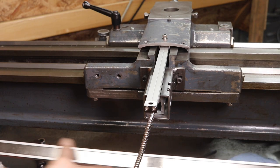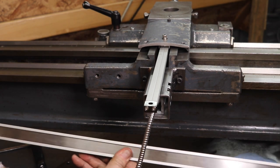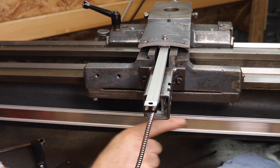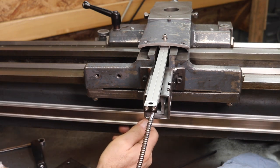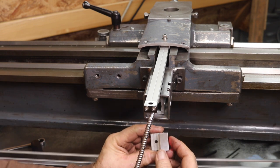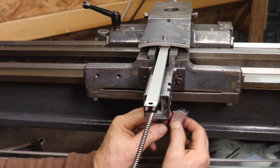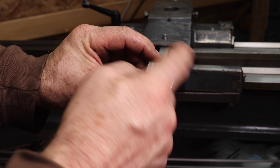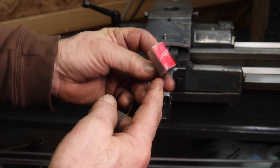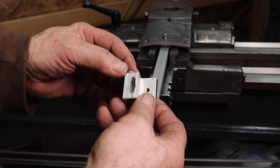I'm working in a very cramped space — the camera is only about two feet from the lathe, so it's a hard thing to film. The scale is about three feet long and I was able to use existing mounting holes on both ends. At the headstock end I made this block that goes on there, and then the scale mounts on the end against it — that's about a hundred-thousandths offset. The scale mounts through this into the ways, and on top I have a screw hole for the cover. These are all just aluminum.